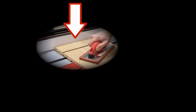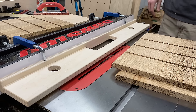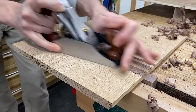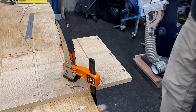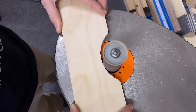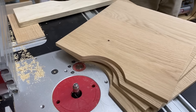I also made a mistake — there's a groove that wasn't supposed to be there on the outside of the case, so I turned it into a design element: I rabbeted out the back for the back panel, then cut a few more grooves in descending size and filled them with walnut, planed them flush, and sanded smooth. I'm using Dominos to assemble the majority of this case along with some pocket screws. After cutting all my mortises and doing a dry assembly to get the divider widths, I cut those on the crosscut sled. Then I made finger-pull profiles on the front of each shelf using a bandsaw and a flush-trim bit at the router table with a pattern — making quintuplets or sextuplets, all identical.